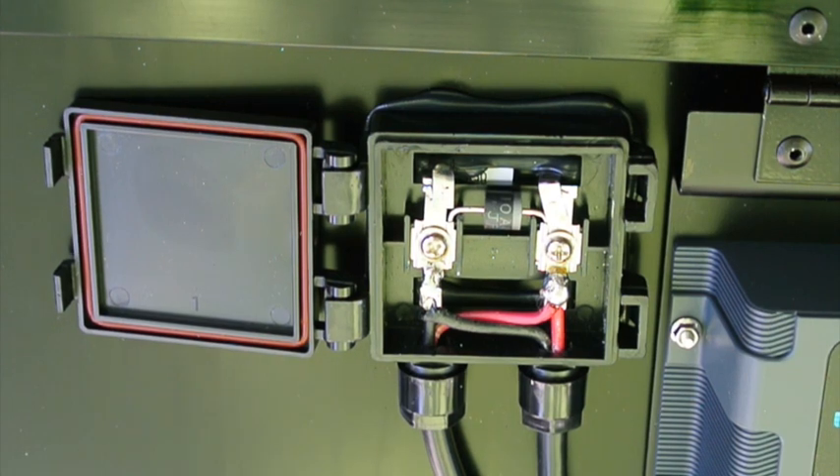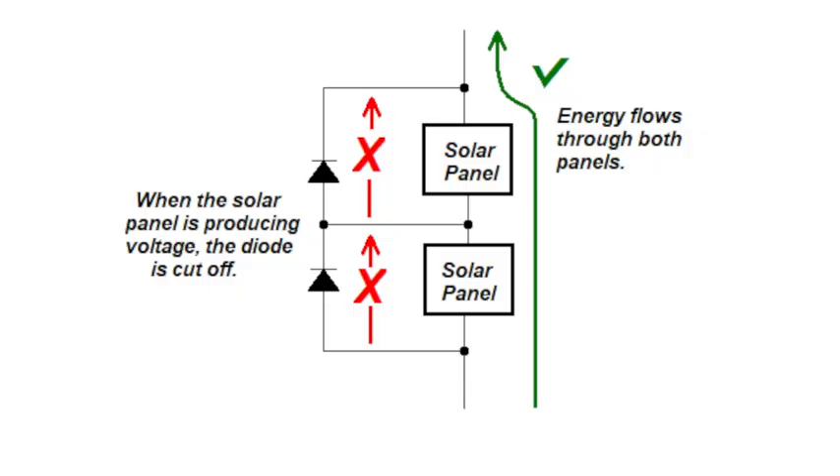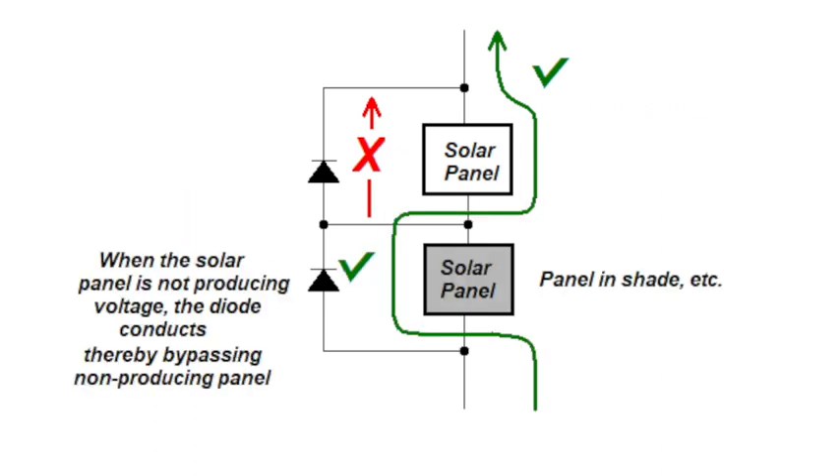As long as the bypass diodes are properly designed there is no issue. In normal operation the bypass diodes do not conduct because the voltage produced across the solar panel reverse-biases the diodes, turning them off. All energy flows through both panels in series, and since the diodes are not conducting there is no voltage drop — yet another advantage of series-connected panels. If one panel stops operating, for example because it is shaded, its associated bypass diode will begin to conduct and route energy around that panel. The array will produce half power but will still give you something. If the diodes were clipped, the energy would try to pass through the non-working panel and could damage it.